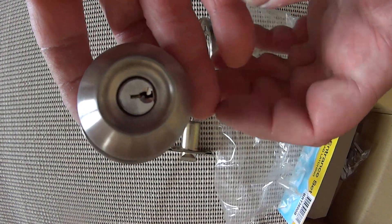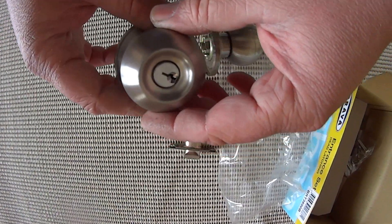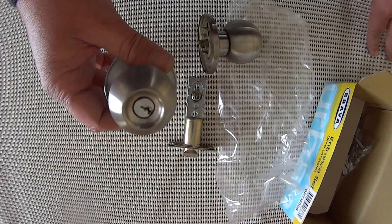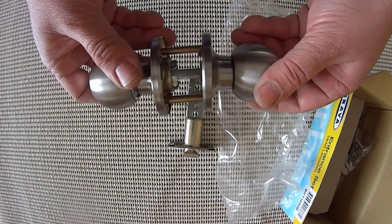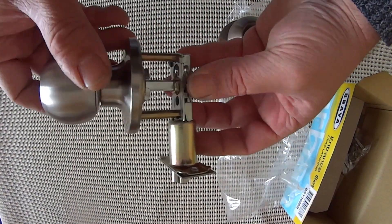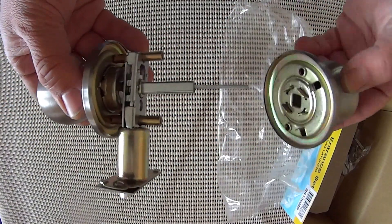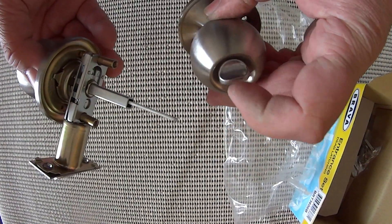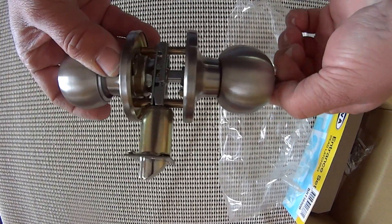That's the best way to install it so your key goes in with the grooves at the top, so your springs are pushing down — that way you don't get any failing springs which will cause you trouble in the future. Once you've installed the latch part, you simply put this part straight through the door through the center section. Then it goes on the back of the door like this. Take note that this part has to slot into this part, so you just make sure that's in there and it turns, locks and unlocks.